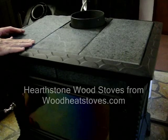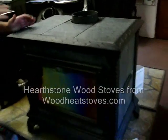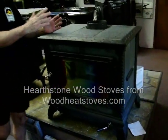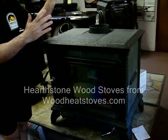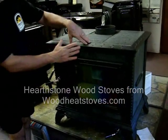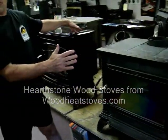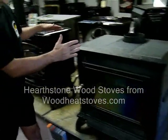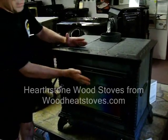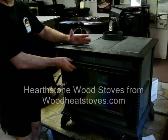On a normal wood stove out of cast iron or plate steel, you tend to see that the flame fires up when you light your stove initially, the temperatures rise dramatically, it can overheat even, and then the temperature drops quickly because heat is transferred quickly through cast iron or plate steel. The soapstone allows the heat to saturate more gradually, although it's immediately radiating out through the glass and the cast iron components.